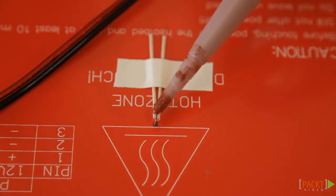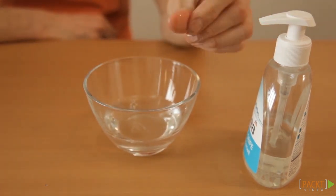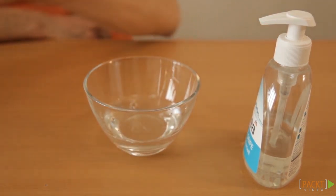Also make sure that you insert it in a way that it's pointing towards the power cables. Apply some silicon glue onto it to fix it. I use special heat resistant silicon here, although common silicon probably will do the trick just as well. With some water and soap on your finger, you can make the silicon blob nice and smooth.